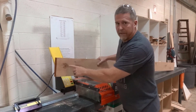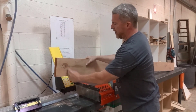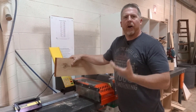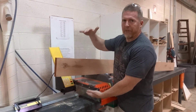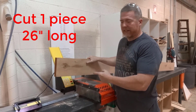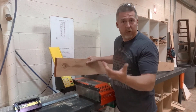Take a quick glance — in this case I see a large knot in the very end of the board. If that knot were further in, I probably wouldn't worry about it. But in this case I can cut that knot off right here. Best guess, you don't need to really measure on the upcut saw. What we're going to do is rough cut to 26 inches long. Our table when it's finished will be 26 inches tall, so minus the thickness of the top, eventually we'll cut it to 25 and a quarter. So rough cut is 26 — set your upcut saw to 26. I always cut off the factory end, always. Since I have a knot, I'm going to cut a little more than our standard two inches, and we'll cut 26.